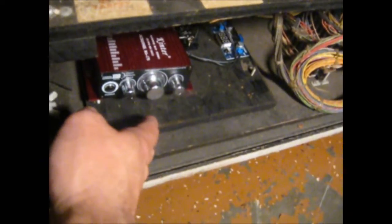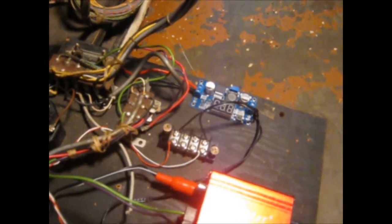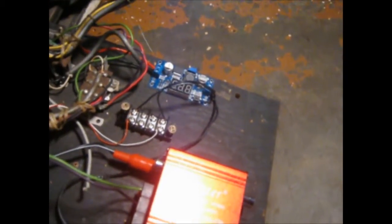So what I did was I had to replace it with something new, and this lifts right out. So what I've done here is the transducer for the recoil spring up top comes down and connects to this preamp. The preamp then amplifies that signal up to something that we can amplify further and send out to the speakers. So that just goes to an amplifier here. And then there's a small power regulator there to give it all clean power. When the game starts, everything comes on and we have a gunshot sound.